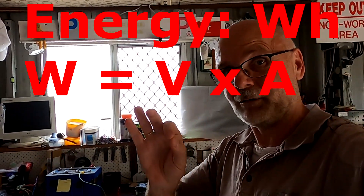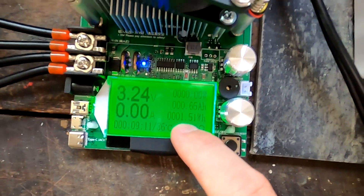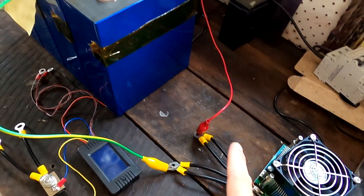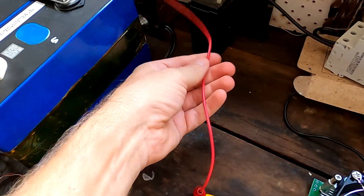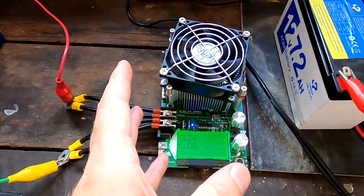Stopping the test here: 0.65 ampere-hours pulled out. Regardless of the connections, regardless of cable length, regardless of how good the terminals or crimping are — none of this matters. The amps going through the cables over time give you ampere-hours, which is the capacity. So don't mix up capacity with energy. Energy is watt-hours, and watts are voltage times amps. If you want to measure energy stored in the batteries, you need to be very precise with your voltage — you could never test it like this because you have massive voltage drop on these terminals.